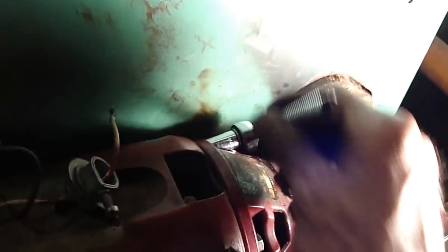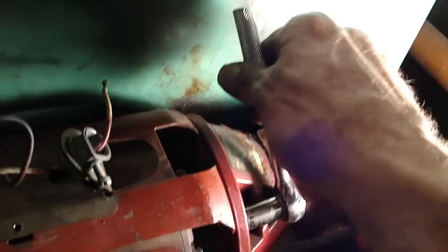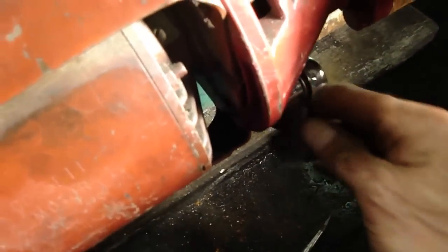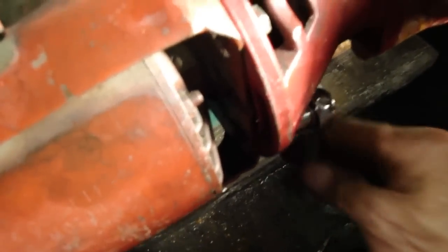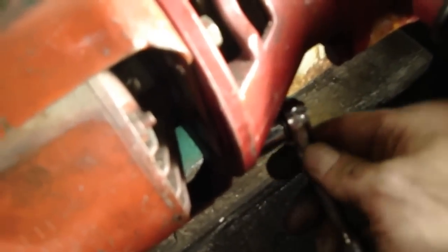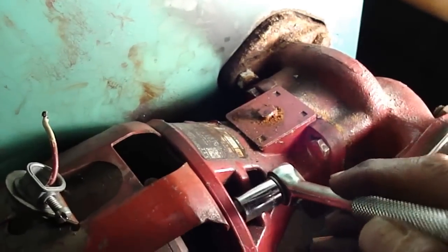I'm putting the nuts back now. You're going to tighten these up like you're putting a tire on — just do a couple at a time and try to get them tightened evenly. You don't have to get them real tight, because if you make it too tight this part here is cast iron and it tends to crack. If you crack it, you're going to have to buy a new housing. So we're making them snug but not real tight.